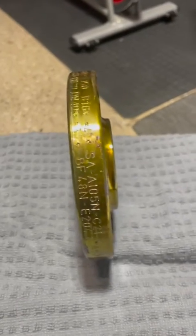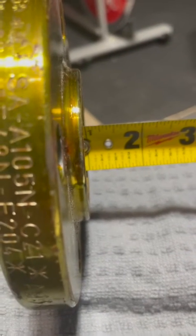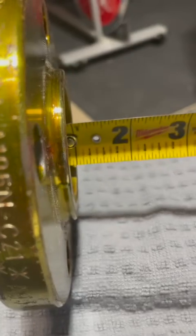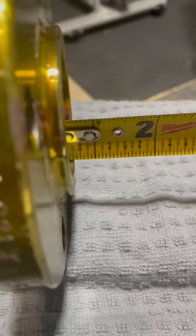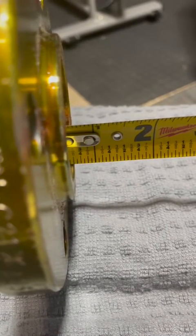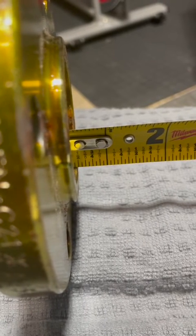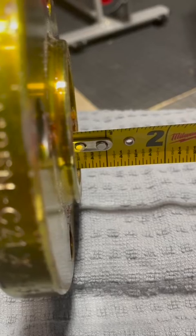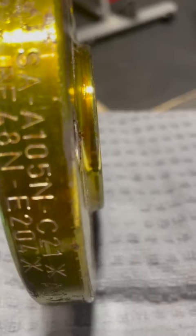What you're gonna do is measure the overall length of the flange — it's one inch — minus what goes in the lip, which is five eighths, plus the one eighth gap expansion, which is a half inch. So that's your takeoff.